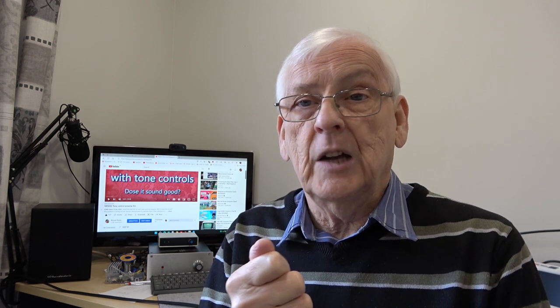The answer is, of course, you just put all the controls flat — in an ideal world that would be the answer. You do have the option of giving whatever cut or lift you think is necessary, but if you want the real hi-fi flat response, you can do it. However, because this has so much lift, putting the control in the center is not very accurate. You think you've got the knobs all lined up equally, but the response is far from flat — you only need to move it a couple of degrees and that's about 3 or 4dB.